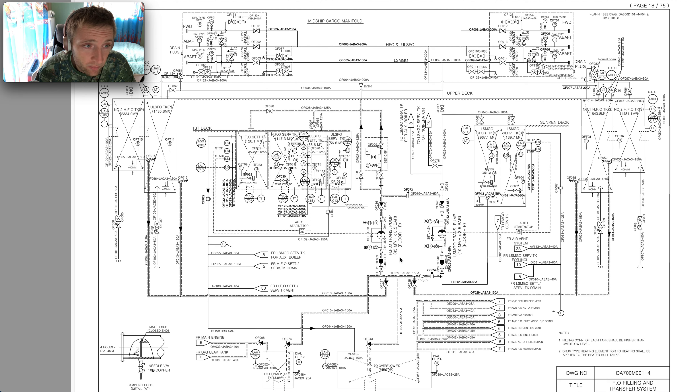The gravity drives the fuel and turns the pump — first time I've seen that. The other case is that the fuel from the purifier, connected on the same line, passes back. How will it flow? A liquid will never choose the difficult way. Always remember this: a liquid will choose the shorter path and the line with the least back pressure to overcome — never the difficult way with greater height or pressure.